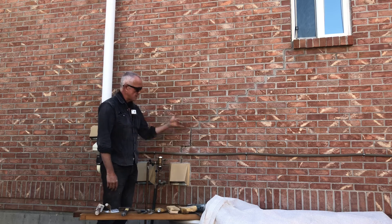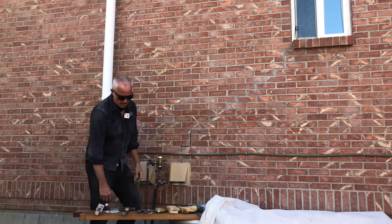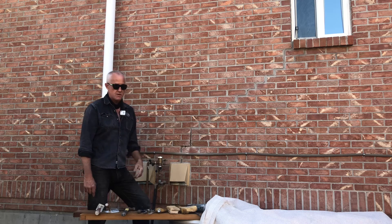There's a crack. Guy selling his house needs it fixed. I'm here to fix it. How do you fix it? I have mixed — this is regular masonry. It's a newer construction house, so Type N masonry. You can get it at Home Depot.